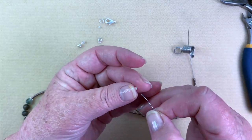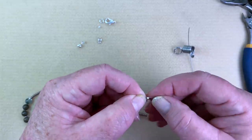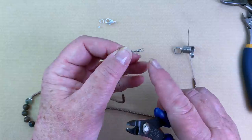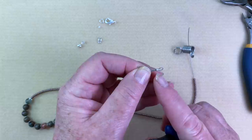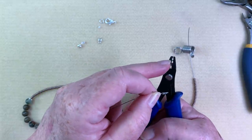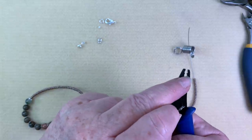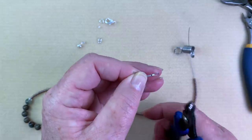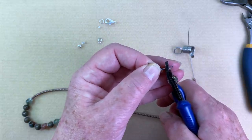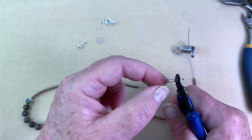I'm going to take one of my crimps, run it on the end, and bring the very end back through. I want to be mindful of where that end is going — I don't want it to twist over. I grab hold of the end to keep control and pull it up, leaving about a quarter of an inch. The crimp pliers have two holes — the innermost one looks like a taco and the outer one looks like an oval. I put the innermost hole right over the top, making sure the entire crimp is covered. I separate them so they create a parallel channel, then give it a good 'scrinch' — that's my technical term.